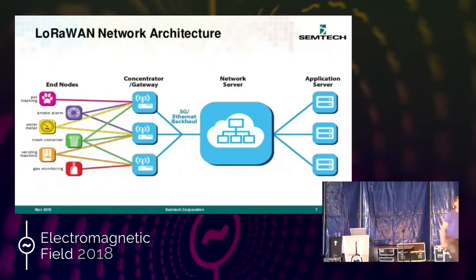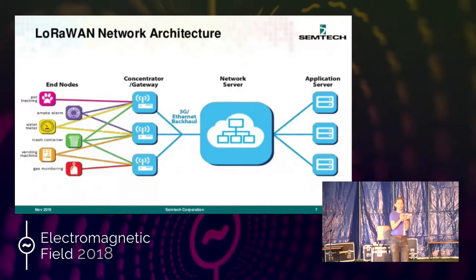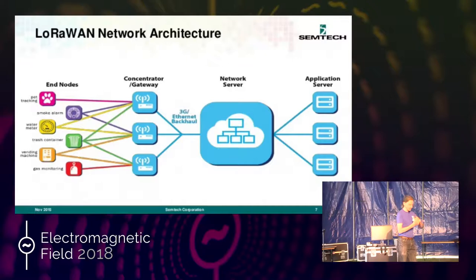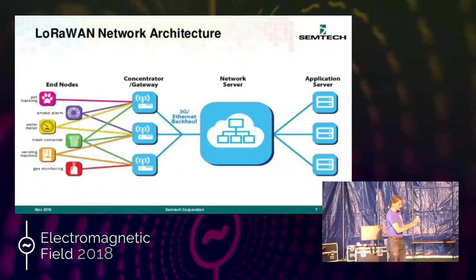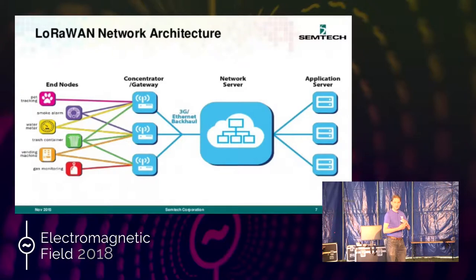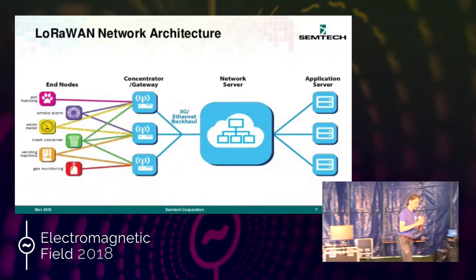So, what's going on here? This is the device. They're low cost, you can get lots of different things. This is a Heltec module which cost me £12. It's a little bit rubbish, if I'm honest. It's got a little round antenna on there. The reason why is because the antenna that was on the board didn't work, so they just modded it and put it on. I don't want to jump ahead at the next talk, but we're going to tell you how we had a very similar system problem with the badges. And don't ever try and solder pins on these because you will break the screen. It's just that reliable at breaking it.